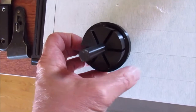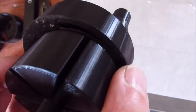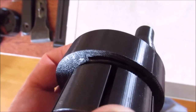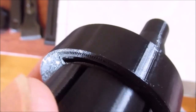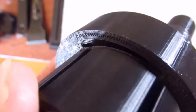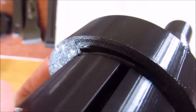As you can see, there's the outlet, and that passageway right there is where the compressed fluid is going to be coming out. Now, one thing about a vane pump, if you reduce the passageway on the output or the input, volumes of water move in a different manner, and eventually you might create what is called cavitation.